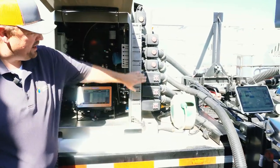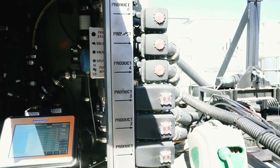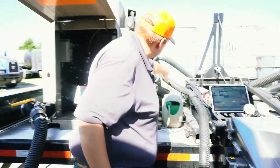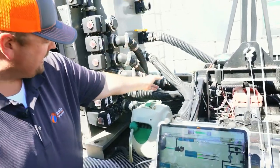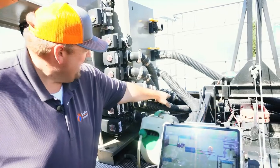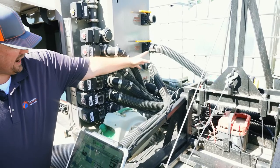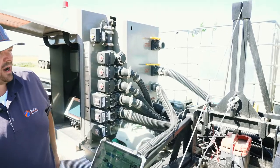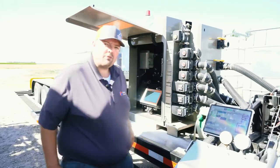So we'll start right here. These are our product connection valves. From those, we have hoses that are going to our bulk chemical totes. Additionally, as we move over and look on the back side of the right-hand side of the cabinet, we have four additional connections. The bottom is our three-inch inlet — that's our water coming in from our pump. Then we have our two connections for our manual eductor, where we can connect for putting in those package and jug materials. And then the top port is our product hose rinse, that we can utilize in order to rinse the hose from the chemical tote through the Quick Draw system.